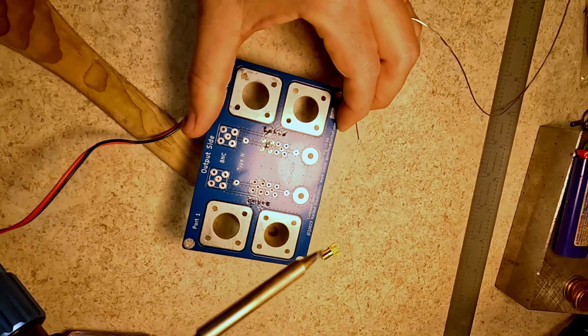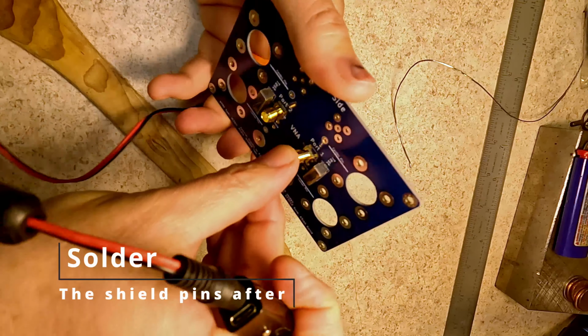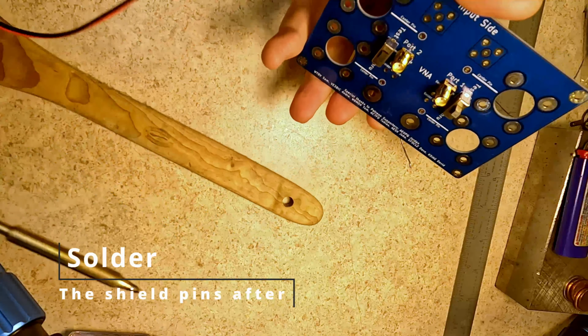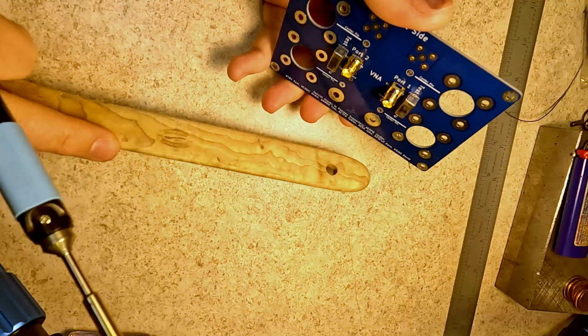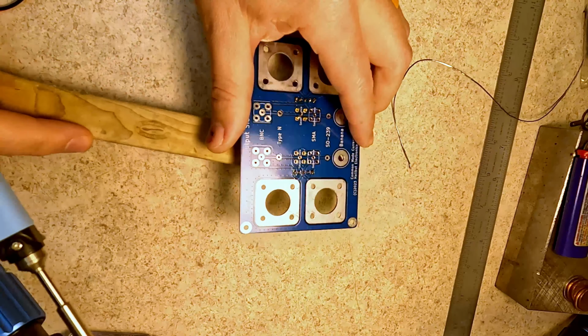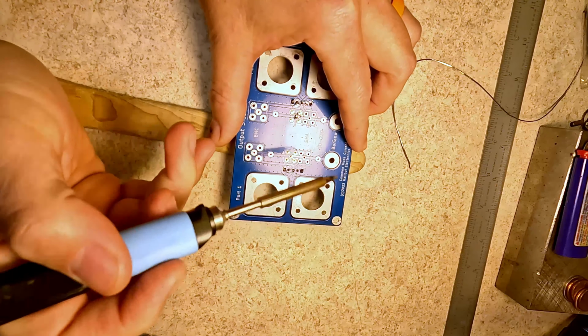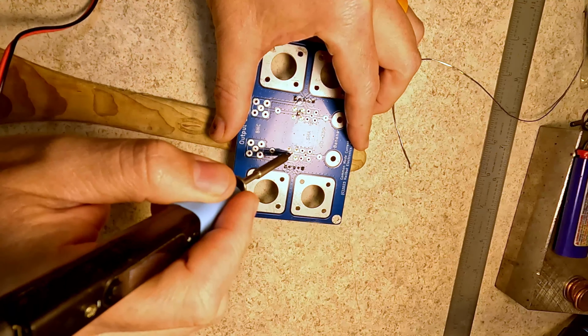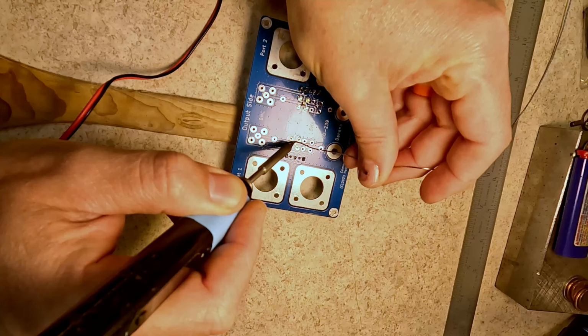So one is done. Perfect. Better lucky than skilled. Solder one in. That'll hold it mechanically so that I can then get the others in. And since doing that to the center pin is easier, because I don't have to worry about spreading heat across the entire socket, I'm going to go with the center pin here.